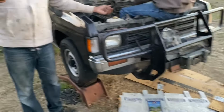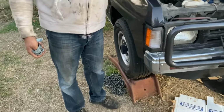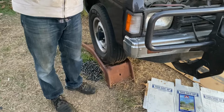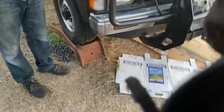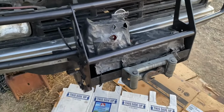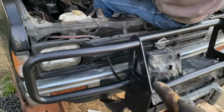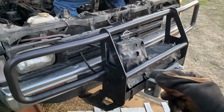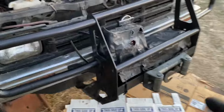But we pulled the back half to the front half is what we did. You have to explain that. We put new upper and lower hinge. We had to pull it together, and we used this. Yeah, basically this is an 8,000 pound winch. But when we did it, man, this thing barely winched the tractor together. That's why you gotta have a 12,000 pound winch.